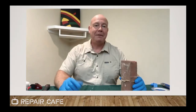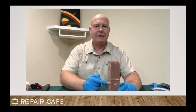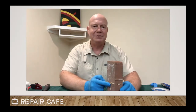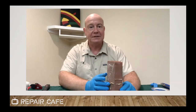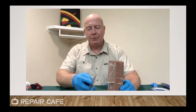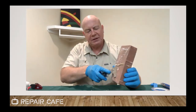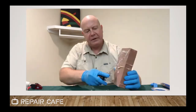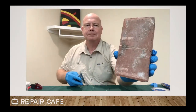Now it's been about 30 to 40 minutes since I glued the brick together and allowed some excess material to solidify. It's not solid yet — it's kind of a tarry, taffy-like texture — but it's no longer wet to the touch; it's formed a thick skin. I can take a putty knife and remove some of that excess without creating a mess, gently pushing the putty knife against there, lifting up the excess and picking it away. So definitely one of my favorites — I've always got a tube of that laying around.